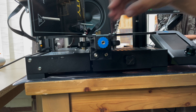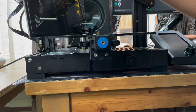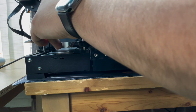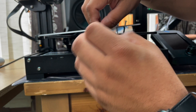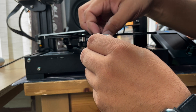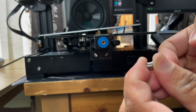Let's take the springs away. While you're in here you can check if your belt is centered correctly — as I can see, mine did shift, so I'll loosen it now and set it so the belt runs straight through. Here's the original spring — I can compress it easily compared to the upgrade spring, where there's not a chance.